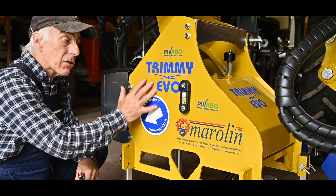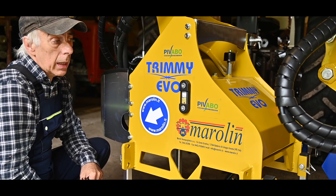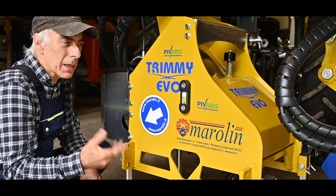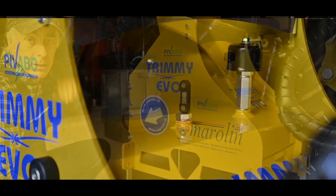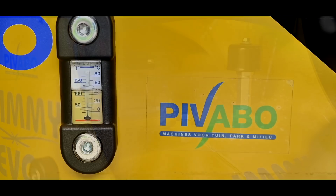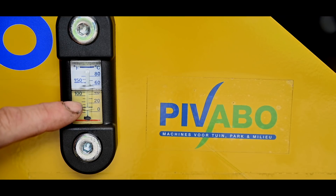The base of the trimmer is a 40-liter hydraulic oil container fitted on legs so it can rest on the ground. It has a combined thermometer and level meter mounted on the side — the first time I've seen that combination. On the side we have the valve control block where all the cables connect to the handles. If the hydraulic oil gets too low, just undo the bolt and fill it up. The combined gauge shows the oil level — currently halfway — and inside a thermometer reads about 20 degrees centigrade, giving both temperature and volume indication.